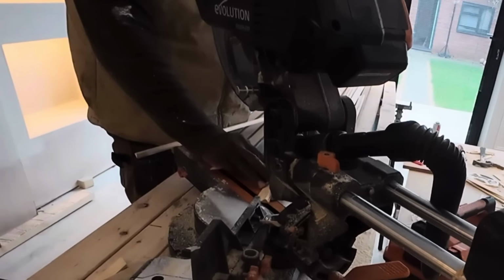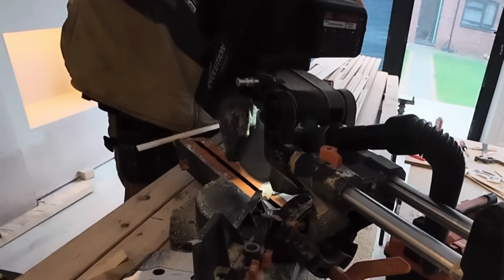And here is the panels marked out on the wall. So I speak to the client, make sure he's okay with the sizes and everything. And he was. So now that the panels are drawn out, we can start cutting the timber to make up the panels. Since we have already made the marks, this is very easy. We literally just measure and then cut, making sure the 45 degree cuts are inside the drawings we've made. So right now, Drew is going to cut while I fit the panels.